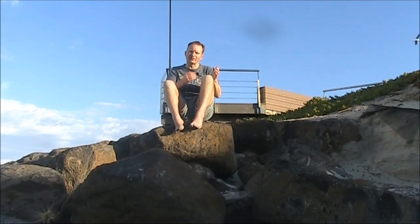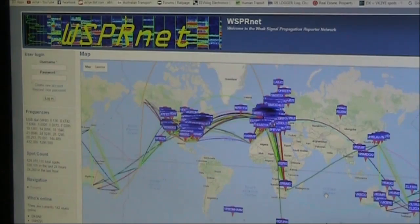Just a few toroids and capacitors is all that's required. Maybe I'm getting a bit ahead of myself, because I haven't yet explained what WSPR is. Weak Signal Propagation Reporter is a slow-speed, high-efficiency digital mode. It's many times more efficient than SSB — a few watts of WSPR is the equivalent of many kilowatts of single sideband. It's a remote beaconing system, and receivers may be connected to the internet, and if they are, they report on this website.